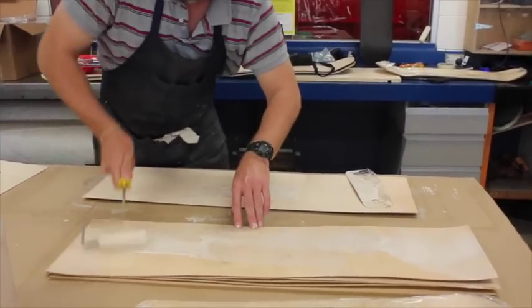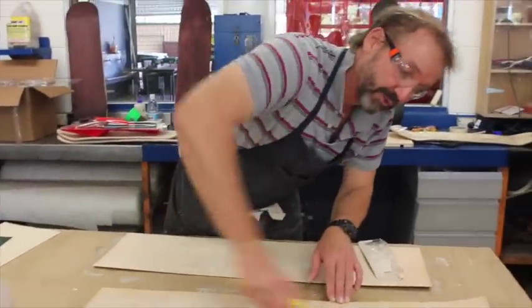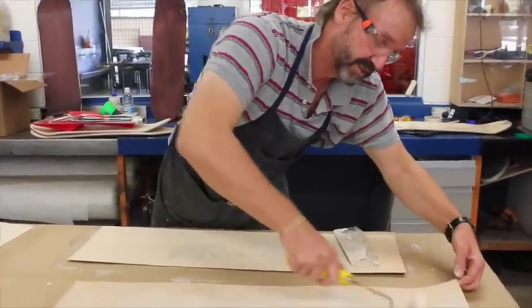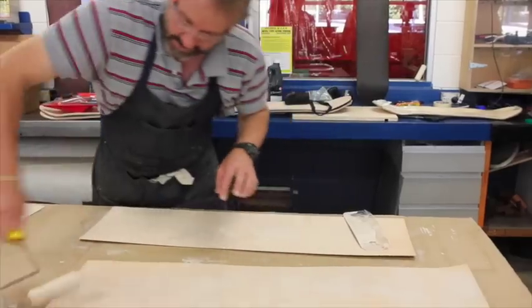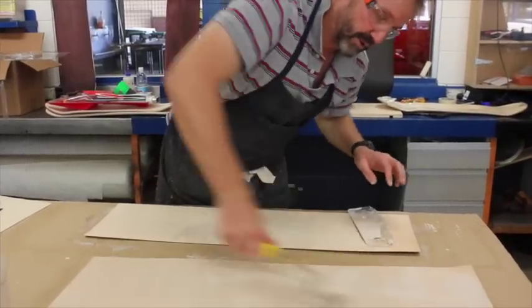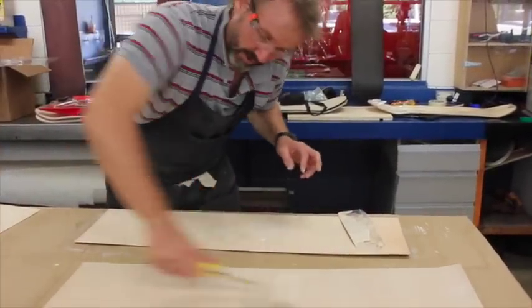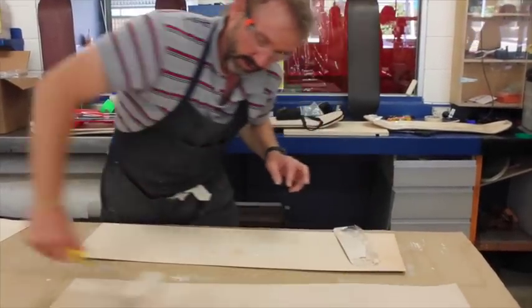What's the benefit of the cardboard? The cardboard will stop the edges of the plywood putting holes in your bag. Because you've got the splinters and the rough edges. You don't want to be chasing little air bubbles or little air leaks. Because if you're using the pump system or a bag system, you don't want those little micro holes in it.